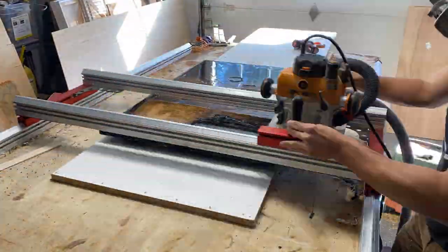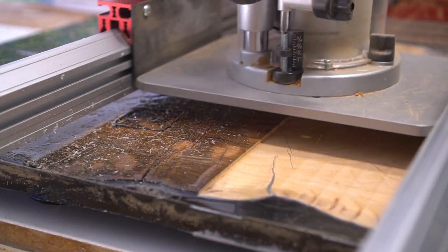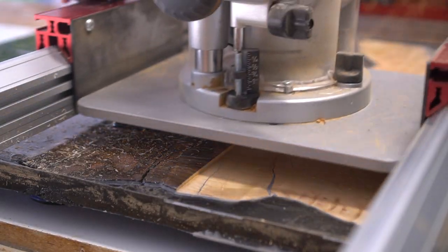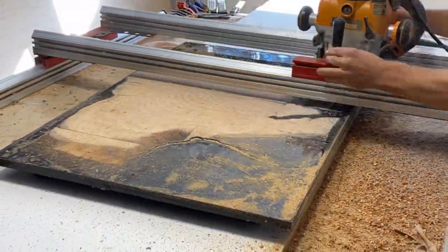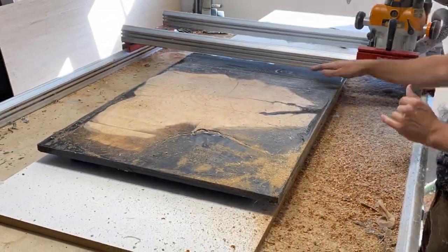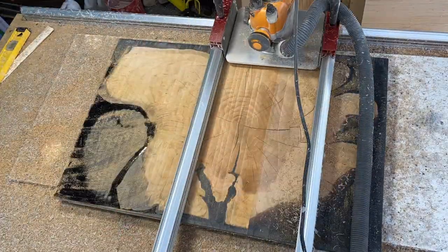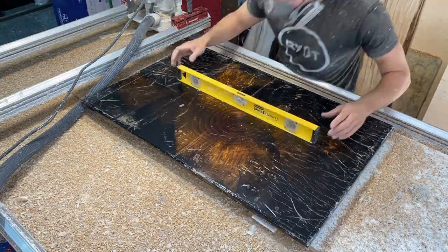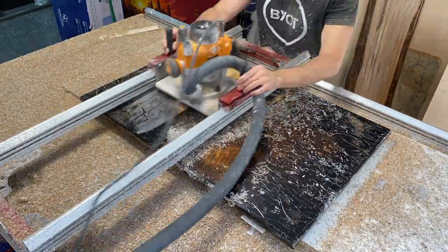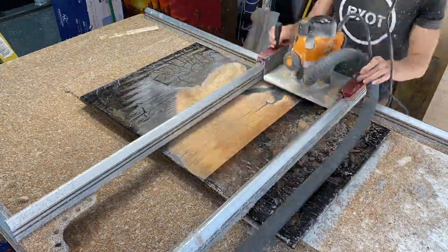At this point we proceed to routering - back to flattening with our milling router sled. This is a lot easier this time because the board is obviously much flatter, however it still takes two to three passes on both sides before I get it to an acceptable flatness. A router sled system is extremely valuable and easy to use. If you want a cheap version, I did do a video on my channel on how to make a $20 version, so check that out if you're interested.